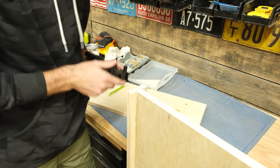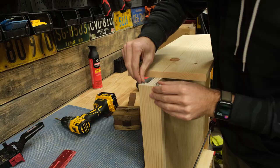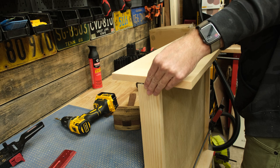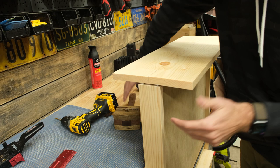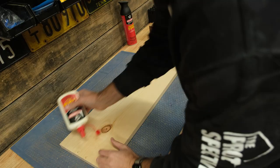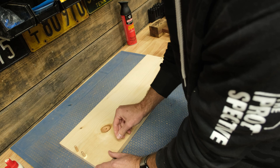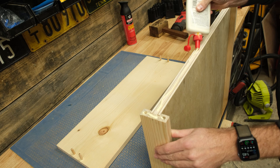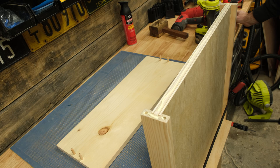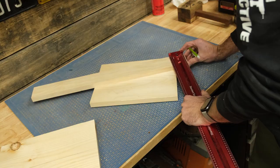This next sequence is going to be an absolutely optional upgrade. I'm using a doweling jig to attach the divider to the base — you don't have to do this, you can use pocket holes instead. I drilled the little holes, I have these little metal pieces that go in there with little sharp tips, I set those in and tap it, and it marks my opposite board. Then I have little holes on the opposite side showing exactly where I need to line up the doweling jig for the next holes. Once all drilled, I add DAP Weldwood wood glue, the dowels go in the holes, I add more wood glue to the base, and tap it right into place. If you use pocket holes instead, wait to put the paneling on the bottom so you can cover those up once everything is attached.